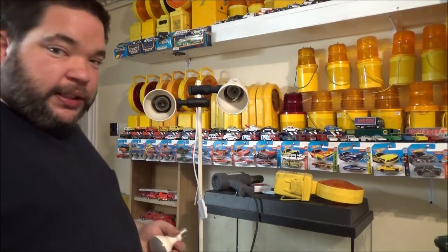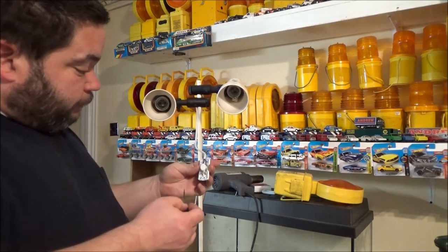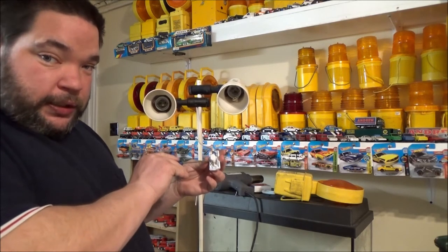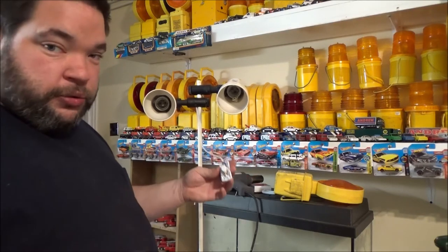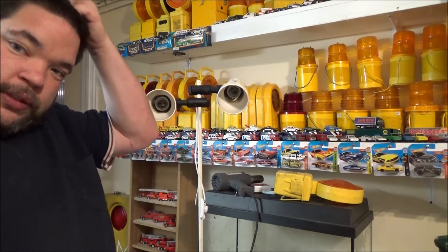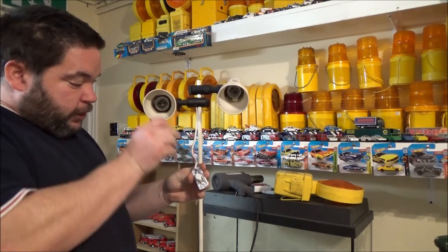So if you are wiring one of these up from scratch or making one, keep that in mind. The other thing I want to point out is that it also matters, at least with this switch, which way around you put the wires. The switches I took off are what they call a double pole switch — it connects and breaks both live and neutral connections. This one only breaks and connects one side. So you want to put your live, your brown wire, on the switched side, not the side that goes straight through. That's where you want your neutral. Otherwise, when you turn this off, it just breaks the neutral, which means power would still be going through the live and into there. So if you accidentally took the bulb out to change it and put your finger in there, you're going to get a shock.